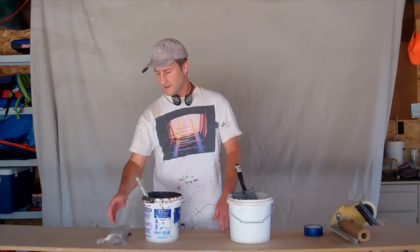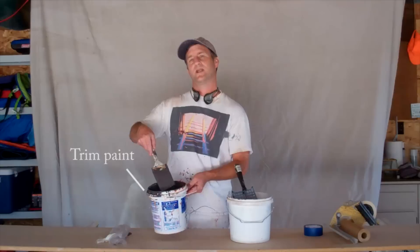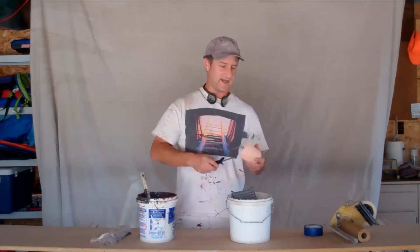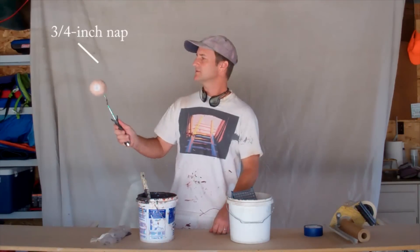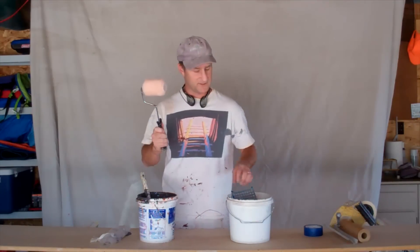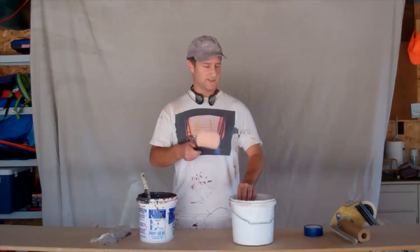The equipment that you're going to need: you're going to want a three-and-a-half inch latex brush — this is left over from when I was painting the soffits. You're going to want a four-inch roller with a three-quarter inch nap, mostly for rolling the corner boards — it works really well and cuts a straight line down the edge. You're going to want a little roller ramp, which costs about a buck and is plastic, and of course a cutting pot.